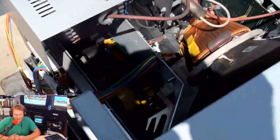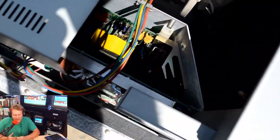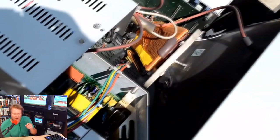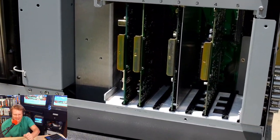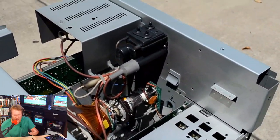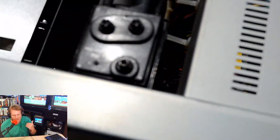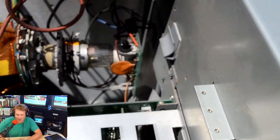Behind that was the power supply — see how it's bolted into that large heat sink and onto that large plate metal? That's right behind the deflection board, going with more of a modular card design, similar to what you'd see in a Sony BVM. On the other side of the monitor there were slots for cards. Four cards were installed. If you get one of these monitors and it doesn't turn on for some reason, go back and reseat those cards — that's a pretty common issue. If those cards come dislodged, they can prevent the monitor from turning on, so you might just get lucky by replugging them in.